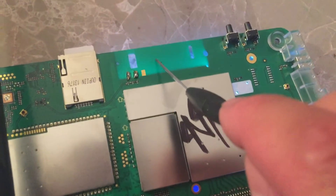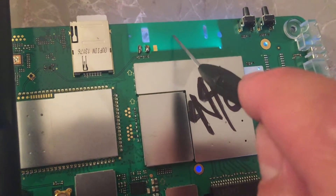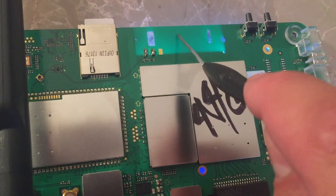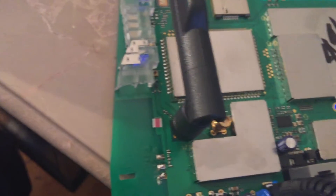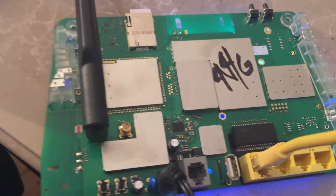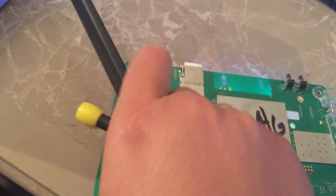Wi-Fi N at 300 megabits. I've removed the LTE antennas — or the 4G GSM antennas — that are on here. There's one antenna up here and then the second antenna is down here. I actually modified this modem to put my own connectors on it, but I took them off so I could show you the board. And then I have an SMA antenna in here right now, and we're going to go to the front of the modem.